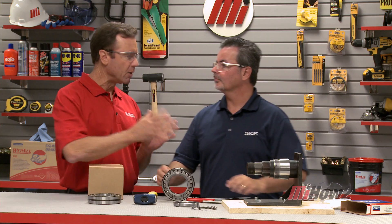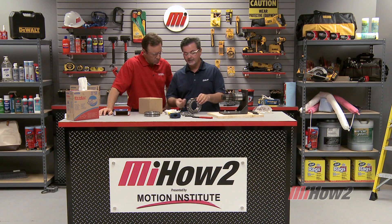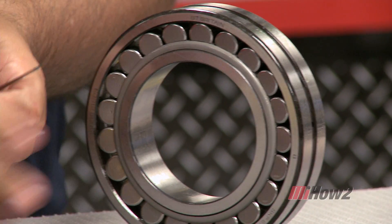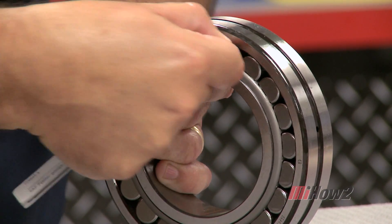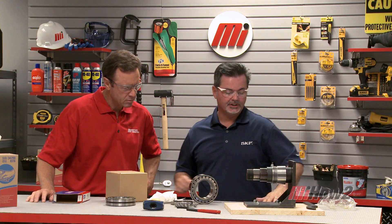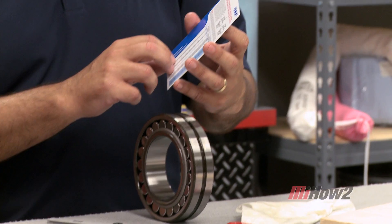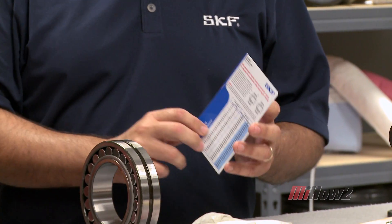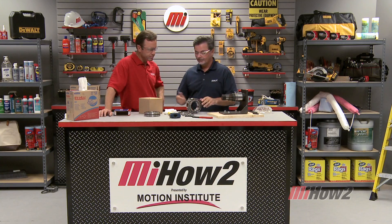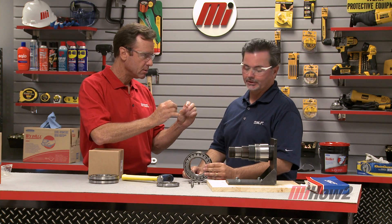Always look for the values on the clearance card. Since we know that the values are between 37 and 47, we're going to start at about 45 and see how that is. You don't want to force it through — just work it a little bit. The 45 is not going to work, so let's try a 40. Based on that we're getting nice movement, so we're going to say the bearing unmounted value is 40 thou. Based on that, with an 80 millimeter bore, we need to take out anywhere between 15 and 25. So based on 40, taking out 15, we've got to get this down to at least 25 at a minimum. Too much and it'll wobble; too tight and you get friction and smoke — it's got to be just right.